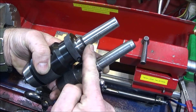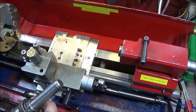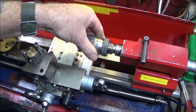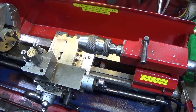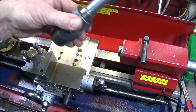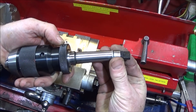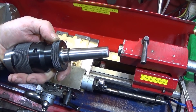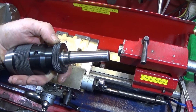This is the smaller chuck I was using originally and this one is about six millimeters longer on the taper. I'll show you that difference on the tailstock — so that one is locked in there now and at six millimeters it will be ejected. Just remember that I took exactly 25 millimeters off the end. If you want to play it safe you can take 20 millimeters off at first and then grind it back a bit more.